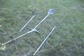Okay, this is the start of my retaining wall here. I've been digging for about 2 hours and I've got this much of it done. There's roots and rocks and hard clay and all sorts of other fun things, but I'm gonna dig it out about 3 or 4 inches down, form it up, pour concrete in it, and make a wall out of it. These are my implements here that I'm using.